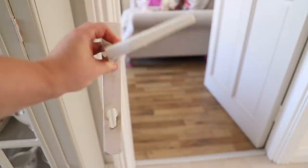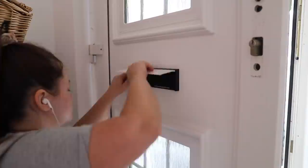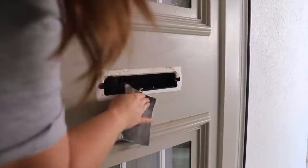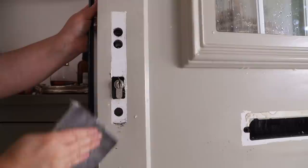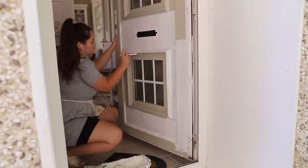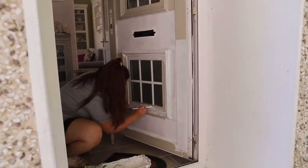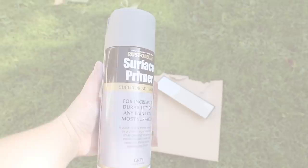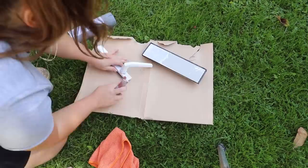I'm taking off my handles and letterbox because I originally wanted to replace them with new gold ones, but I couldn't find the right replacements in B&Q or Woody's — you have to get ones with the exact same screw placement. My friend Joanne sent me a link to an Irish website with handles that would fit, but I'd already started spraying mine. So my plan is to spray the handles in Rustoleum Bright Gold, stick them on, and if they don't wear well I'll replace them properly. I'm putting on one coat of primer first and letting it fully dry, then moving on to spray painting the handles.